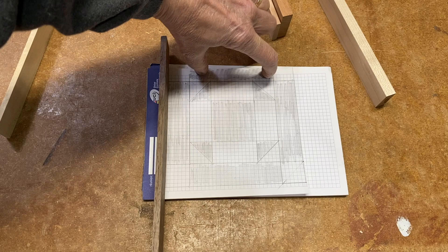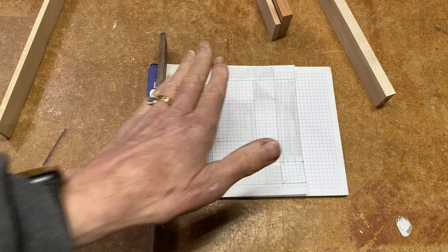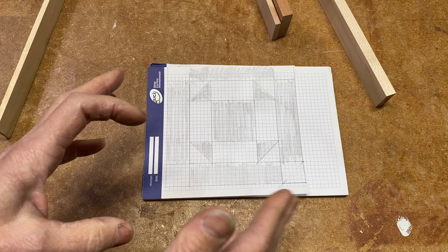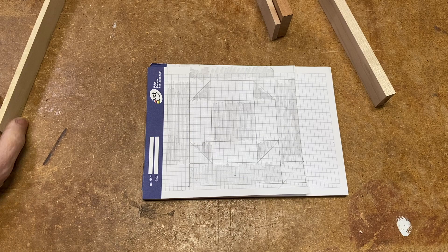I just need to cut off the 45 degree angle. For the outside parts, that's also going to be quarter inch walnut stock, matching it up to one inch sections for each of the outside and for the cross piece. I'm going to want to mill some one inch thick stock, using five-quarter stock to bring it down to one inch so that my grain is all going the same direction. I could also make a very wide board of all these layers, then make individual squares and cut them up afterwards — that way I'm doing the angle corners only once. I'm trying to use up a lot of my scrap stock, so if I have flaws and defects, I just won't include those in my glue-up.